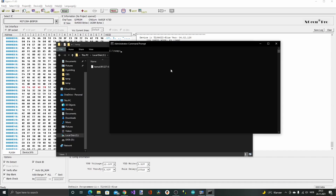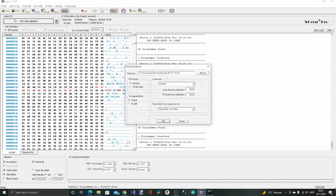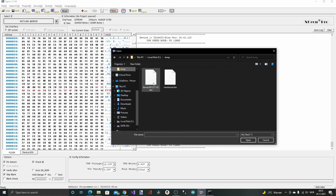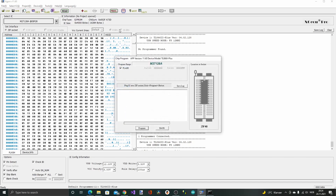Since I'm using only one ROM of the two that can fit on the chip, I need to copy the same ROM onto both areas. I do that using 'copy /B' — binary copy — concatenating the same file twice with a plus sign, and calling it newkernel.bin. This creates one new 32K file. I load that in and we can see it now says 'ARCTIC RETRO BASIC'. Then I hit the program button.